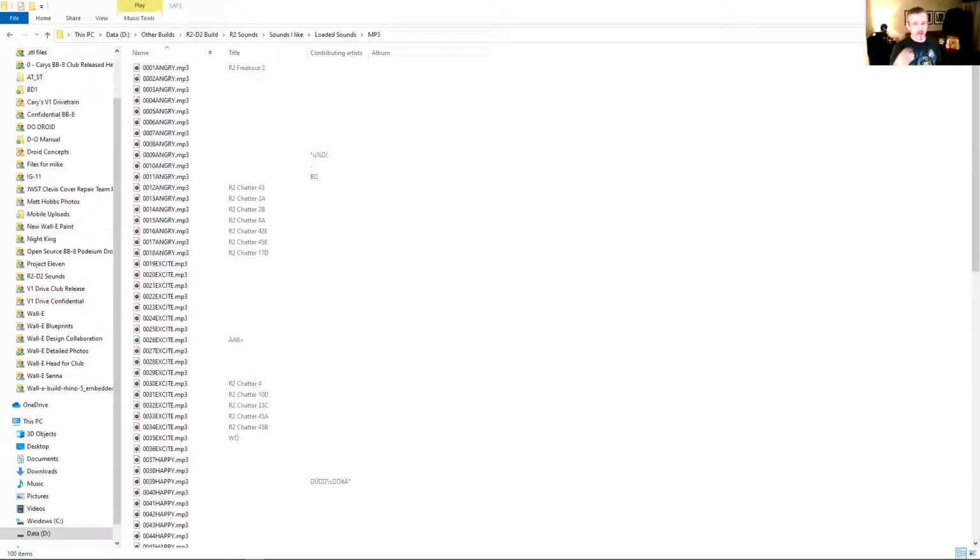So you don't have to load these in any particular order, any particular timestamp. All it is looking for are these first 4 numbers. So this allows you to put 1,000 sounds on your card. Right. Okay, so you're customizing the order in how you name the file names, but the actual Kyber control is just looking at those sequential numbers. So whoever asked that, if you wanted your random sounds to be in a specific order, you would just organize them and name them in the order you want.